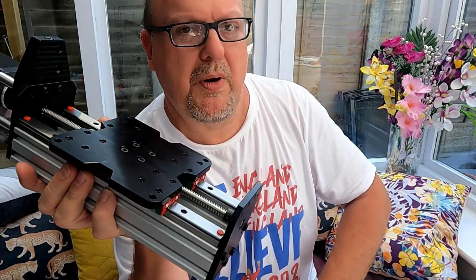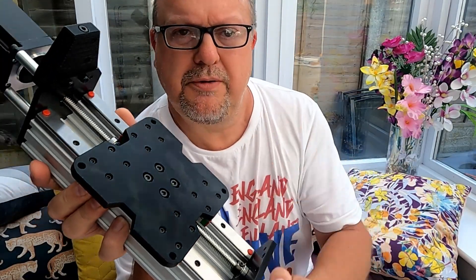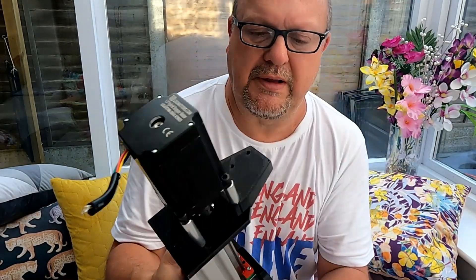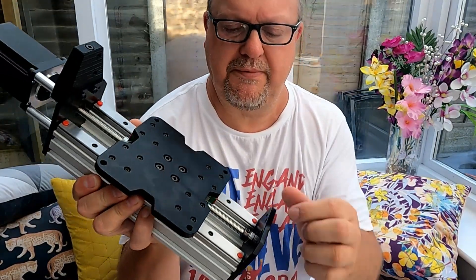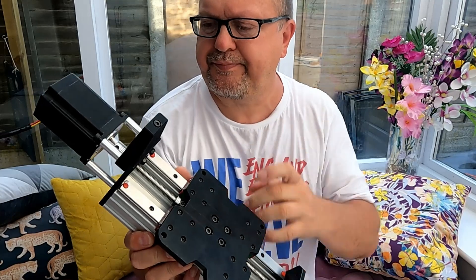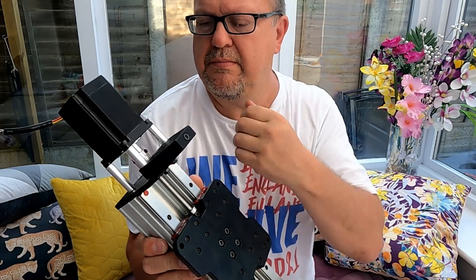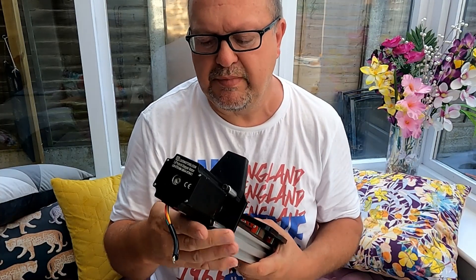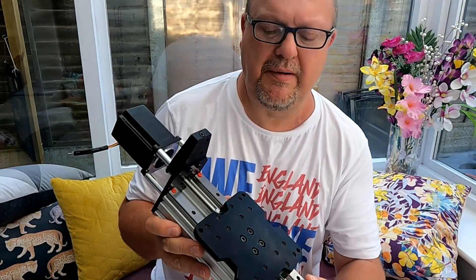I did mention on the Facebook group — no one's replied yet — I posted about these posts failing on the screws, then I realised my own mistake. One other thing I posted about was whether it's advisable to grind the end of the lead screws down and put a small flat on them so it grips in the coupler better. But I think when the grub screw nips on it should grip on the thread of the lead screw and actually be fine.